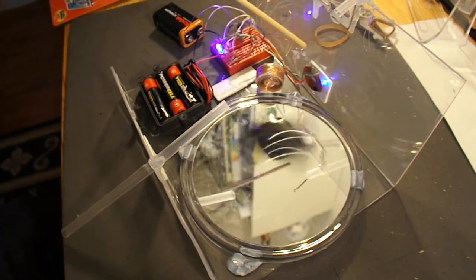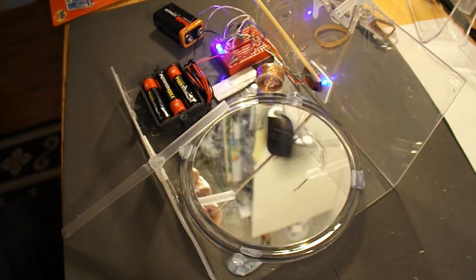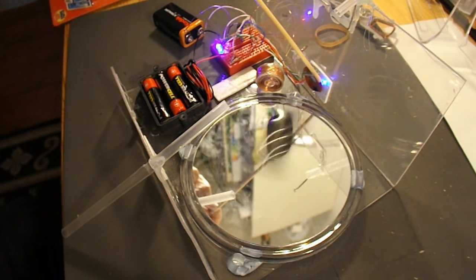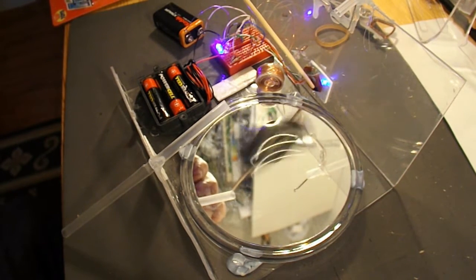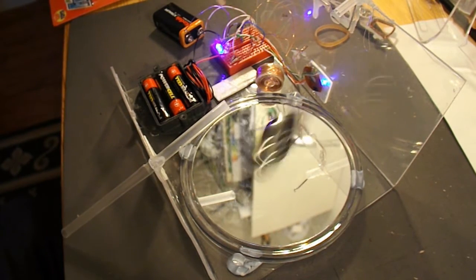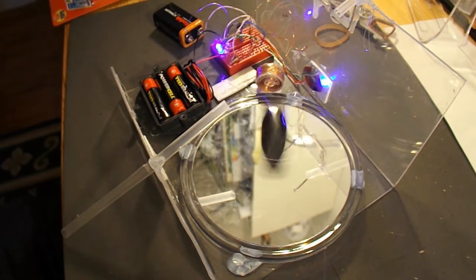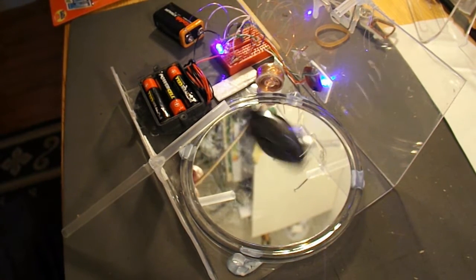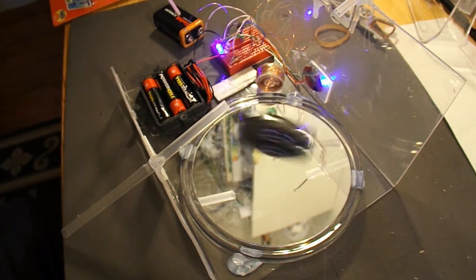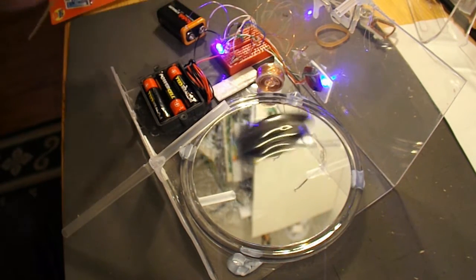I expect I could just point a couple of things out over there. That's the Hall Effect sensor out of a fan — it's actually a notebook cooler fan. The sensor is actually the dark bit just there. The LED was part of the circuit anyway. Over here is the circuit I rigged up. All we've got is one transistor and a few LEDs. Four and a half volts to run the whole sensor and that bit of circuitry, and a nine volt to run the rest of it.